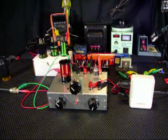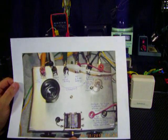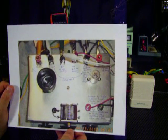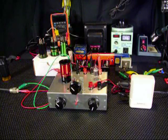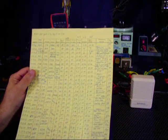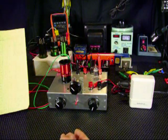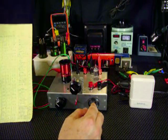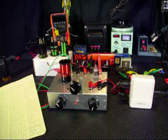I'd like to show you a few other things before we wrap this up. It's been so long since I've got this radio out and dusted it off that I kind of forgot how to hook it all up. So what I did a long time ago was create a little pictorial diagram of all the connections — that can be very useful. I also kept a little log with the date and time, frequency, call sign, and location of stations, along with the antenna settings, capacitor settings, and regenerative settings, with program notes.